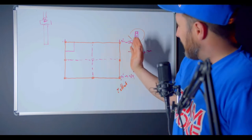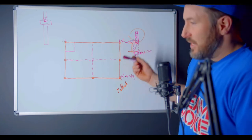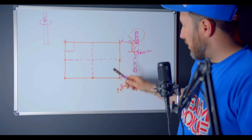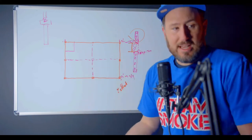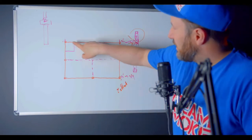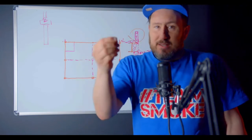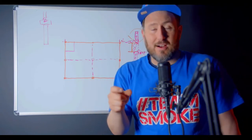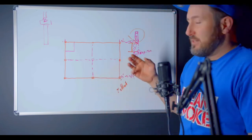We talked about how we're gonna fit the walls inside, in between columns, and then you're gonna come in 8 inches or 6 inches or whatever your thickness is for the wall, just snap your lines. I always snap both sides of the line for some reason. I just do that if I can, right? And you can't always. But yeah, and then this will all sit on the grade beam. The grade beam will be wide enough for you to put your wall on. And a lot of the times, the Dens glass will come down flush almost to the grade beam. So you'll come in like 5/8 or half inch in from the grade beam even. But it's not always the case.